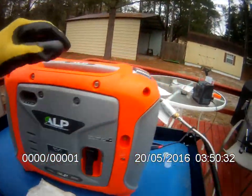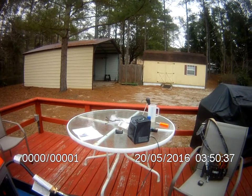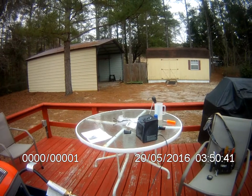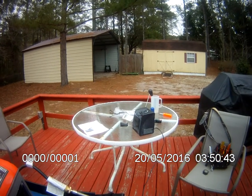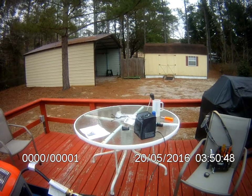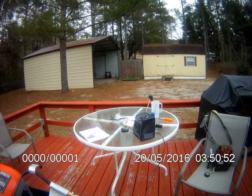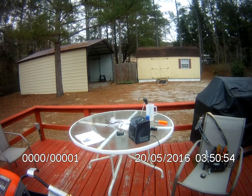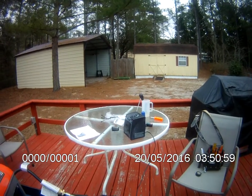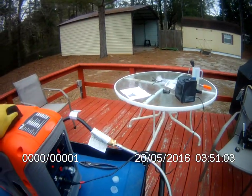Now, for testing, I have a ceramic cube heater there. I tested that with the kilowatt meter inside the house, and at 121 volts, in the medium position, it started up at around 600 watts, then went up to around 800, and then settled down under 800 watts. So I'm going to use that as my test load when I start this.